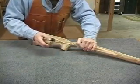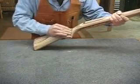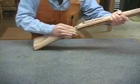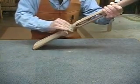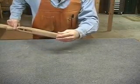For radius areas, I use a round sanding block. In some areas it's not practical to sand with a sanding block or sanding dowel. Here you can sand by hand. An example would be in the wrist area and up on the fore-end tip.